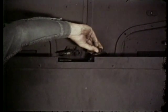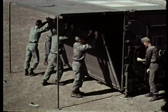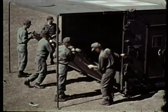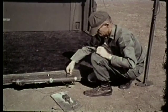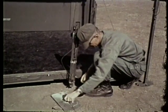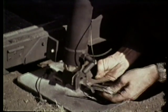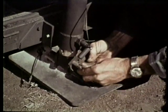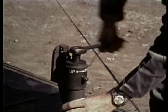Release the latch assemblies at the center of the raised floor and at each side. While lowering the floor, attach the hook and cable assembly. Position the jacks upright. Attach the base plate to the jacks. Operate the jacks until the base plates contact the ground.